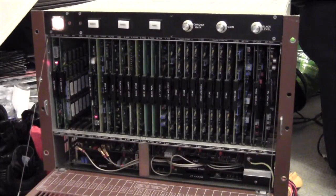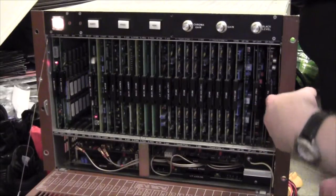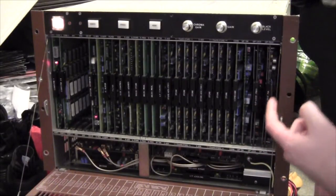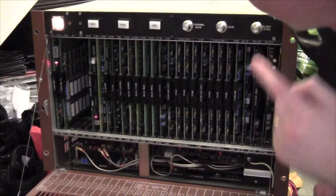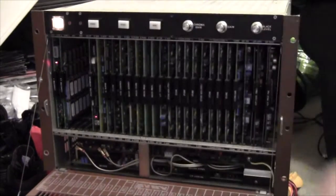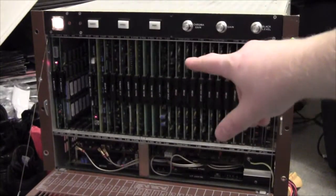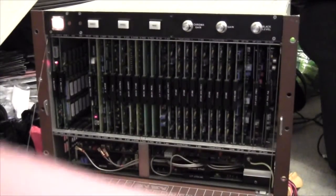Now, as I've said in the email to Ash, this is the spare CPU board, which I've refitted with new caps. It's got the lights on, and since I've put that in, the PSU is making the booting sounds. On the decoder down here, if I quickly grab Mr. Camera, we now have many more lights back there. It seems much happier.